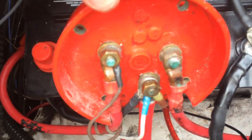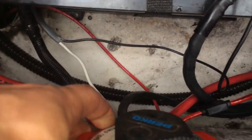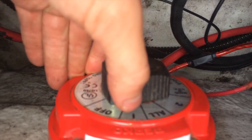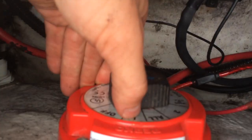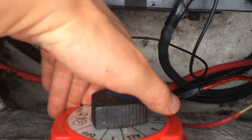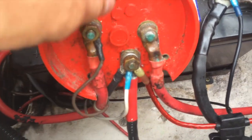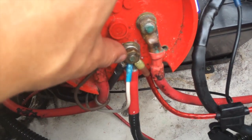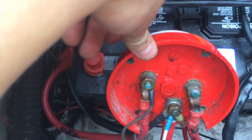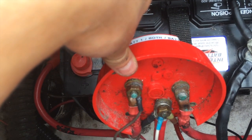So that got me thinking, and I want to show you what I did to fix it. This is the back of a dual battery switch. The switch lets you select: off, battery one, all batteries — both together — or battery two on the starboard side. What I just did is connected the amplifier to this middle post, which allows me to run the amp off whichever battery is selected, or both.